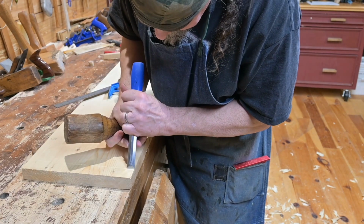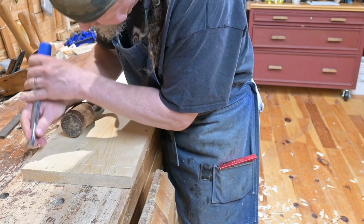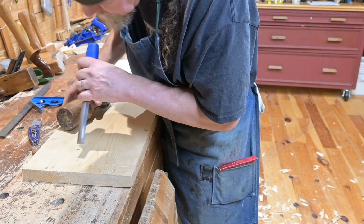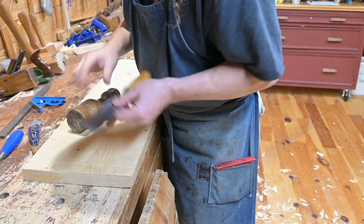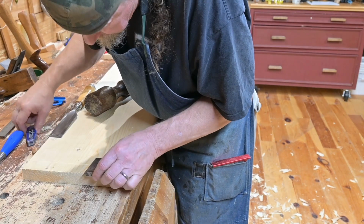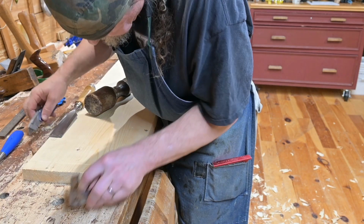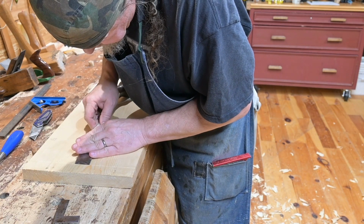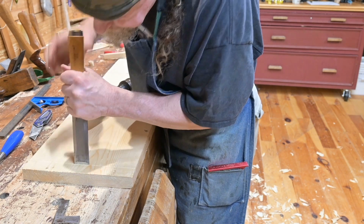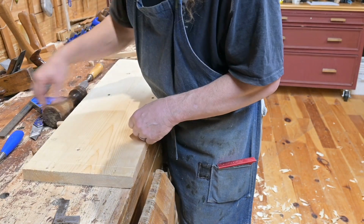And it looks like they did mark evenly, so now he's marking the two end dovetails. They're kind of like half dovetails. And now he's taking a larger chisel to mark and center that squarely after he squares off that center line with a square. And he basically eyeballs this. When I've done this before, I've actually put a little mark on the chisel blade so that I actually get it exact, but he's pretty good with eyeballing it.